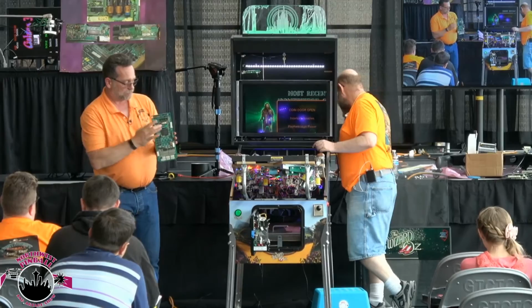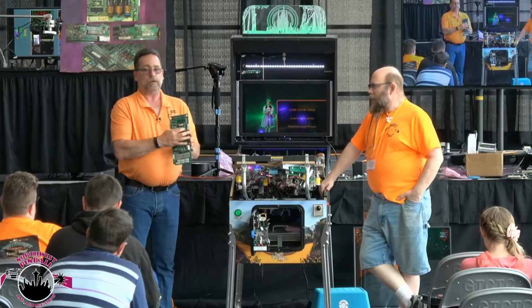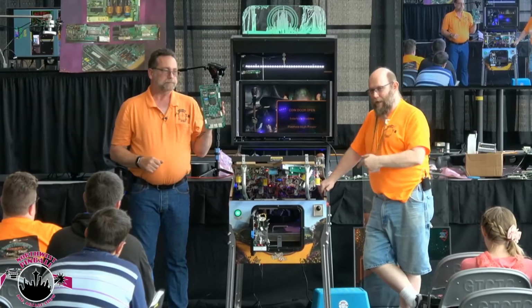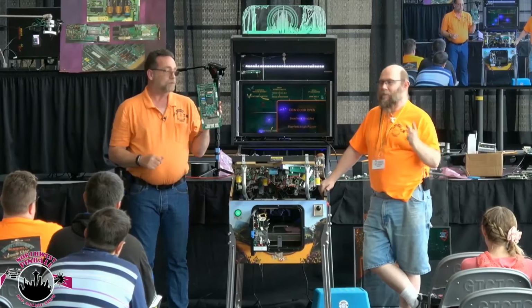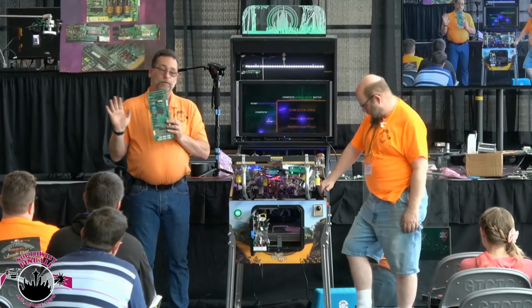So another thing, when you remove the CMOS, it's rarely ever going to be socketed. So the best way to do it is to actually cut the chip out, cut the legs on the chip. Wait, one step back. The best way to do it, if you don't have a clue what you're doing, is pay one of us. True. Because we will do it right, we will warranty the work. If you do it and then we fix it, you're still going to pay. I do have to throw in another plug for Rob Anthony Lockwood Litt. If you have NVRAM and you buy it here at the show, I believe that he will install it for free while he's here.